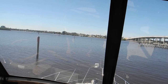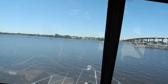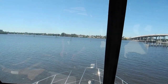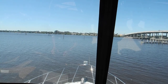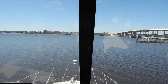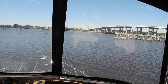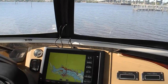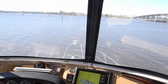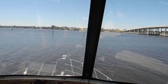Melinda, which piling is red up there? Going on the left. So go between the two — it's a red piling and a green piling. These are not real channel markers by the Coast Guard or the Army Corps of Engineers. Can you feel the wind coming in the right-hand window? That wind is pushing us a little bit to the left. We've got 2.6, 2.8, 3.1 under keel. Steer right — the wind is pushing us.